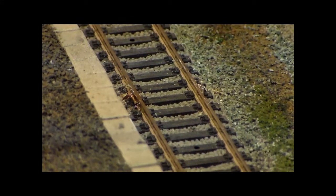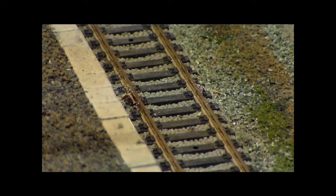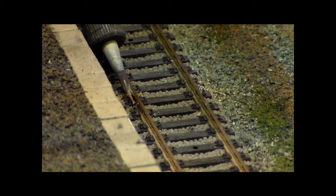Now I'm getting very ambitious, because this one is right in against the platform edge. Of course, this is retrofit work. Another reason why it's probably highly likely that you're going to get a dry joint unless you're very careful is, of course, this track is going to be tarnished if it's been down for a long time.